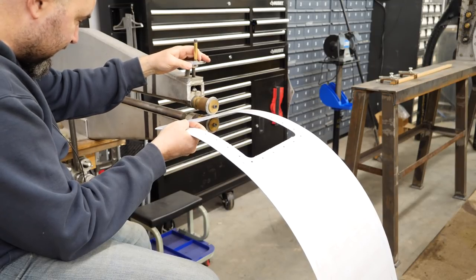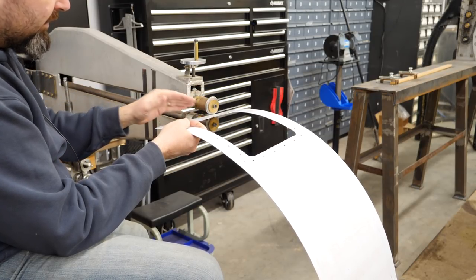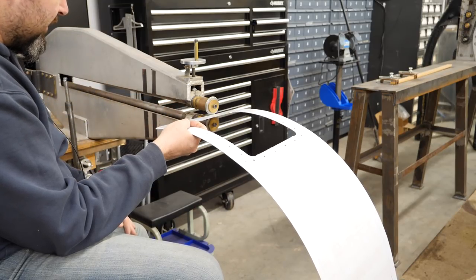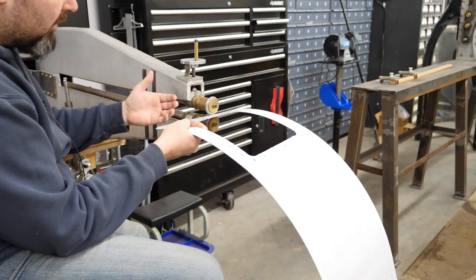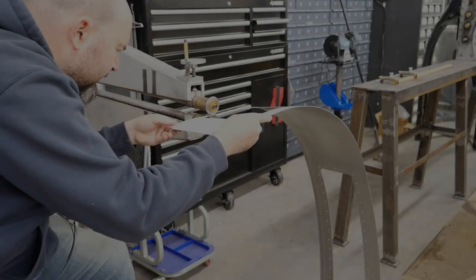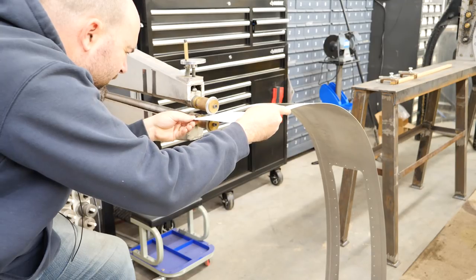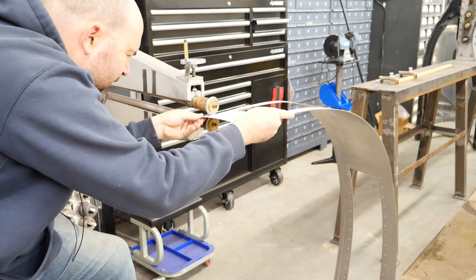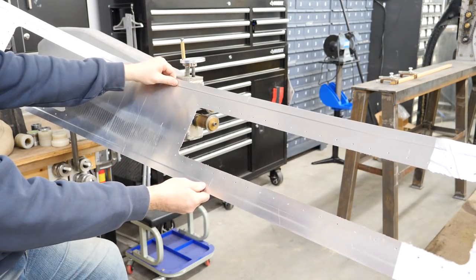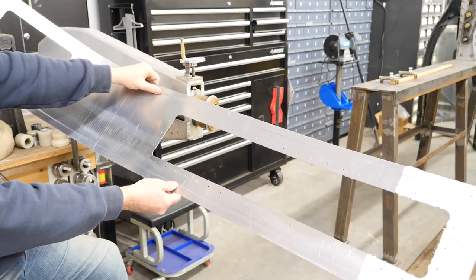If I had a table in this situation — the material has now gone at an angle, and it puts a little bit of extra pressure at different points on it. Because I've got the protective coating, it's not an issue, but I'd probably get a deeper, sharper form if I had a table supporting this bottom lip and keeping everything flat. So that's the bottom of it there. It looks pretty good from everything I can see. Take a rest, and then I'll do the next one and get my eyes back to normal.